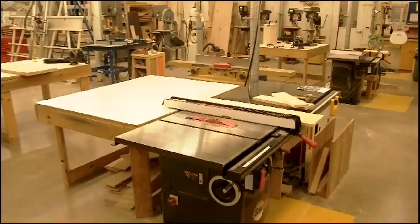For you guys in the beginning, flattening, straightening, and squaring the edge of the board is its sole purpose as far as you're concerned. We do not put sheet goods through the jointer — only solid stock: poplar, pine, alder, cherry, maple, oak. We don't put plywoods through the jointer. There's no reason to.